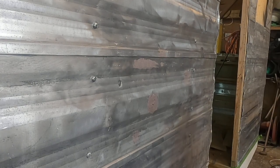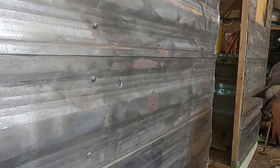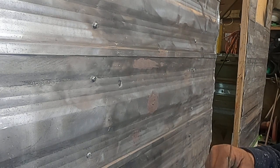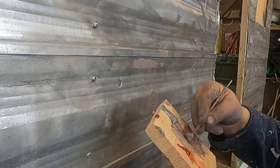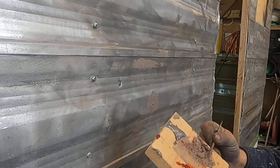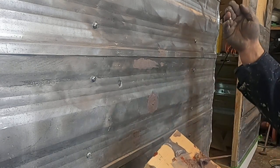All right, mix up the rest of our hardener into our metal. Make us up another batch here. Johnny on the spot fast. Take our little welding backup rod. There are different ways to apply this. You can see how this is adhering to the welding rod. That's kind of a nice thing, and I'll show you why. It makes it so you can actually apply pressure and roll it in. That's a different technique, and I'll show you that one. This one we did flat.